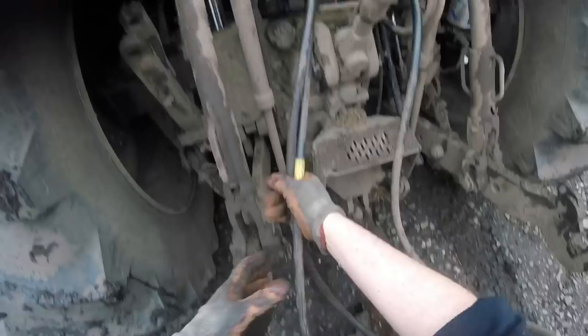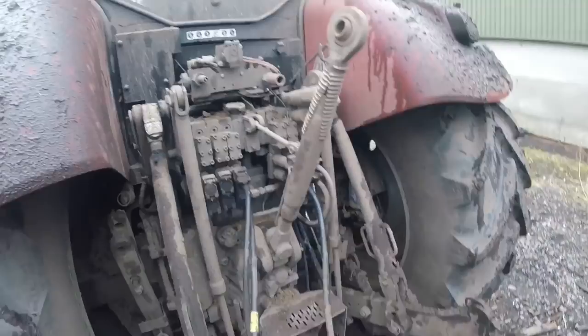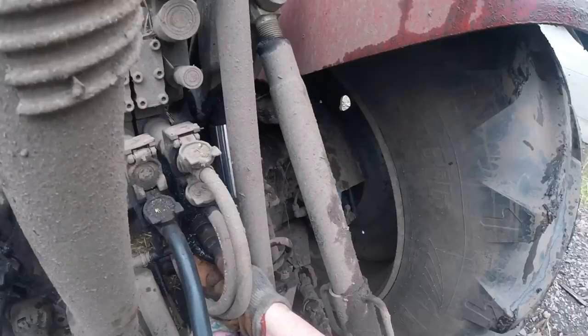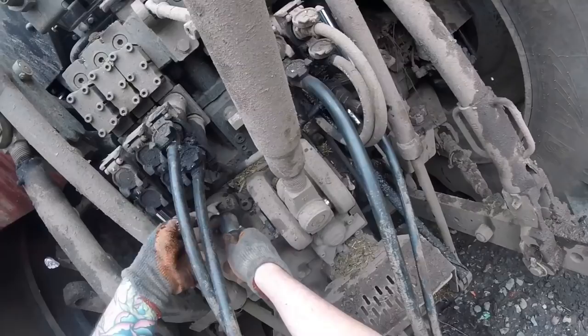This one — you get air brakes, you get ABS, that's my ABS plug there, and you get hydraulic brakes. Basic bog-standard trailers have hydraulic brakes with a little slip collar. You pull that slip collar back, push it on, and as you're pushing it on you push the slip collar on — and that's the trailer brakes put in. This one is just a seven-pin plug — lift that little flap up, push that in, and she's in. That's it.